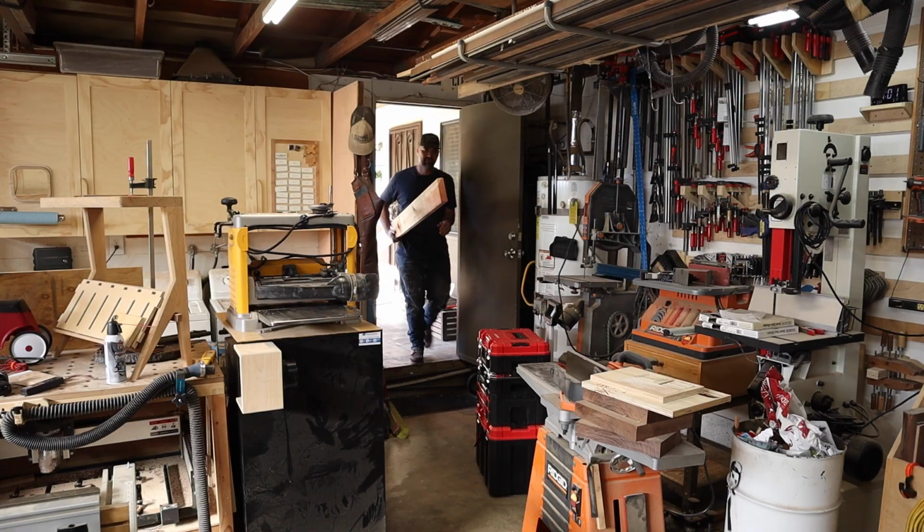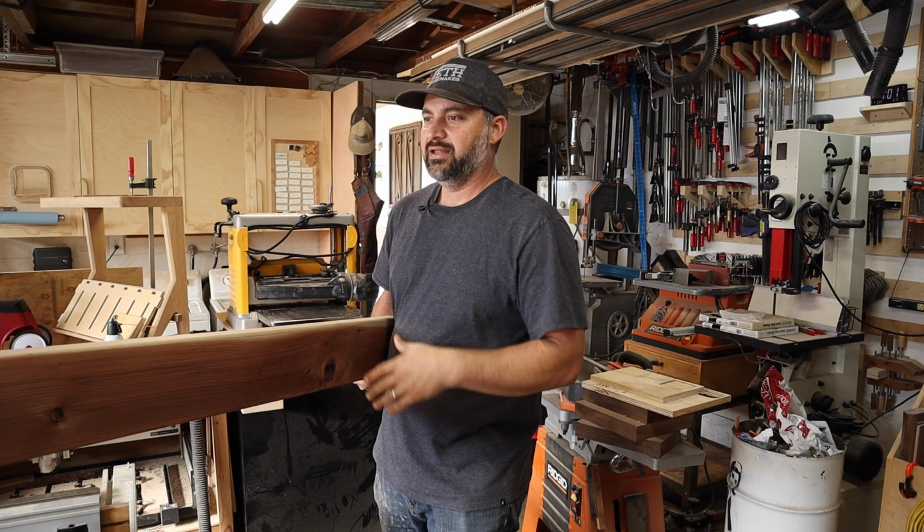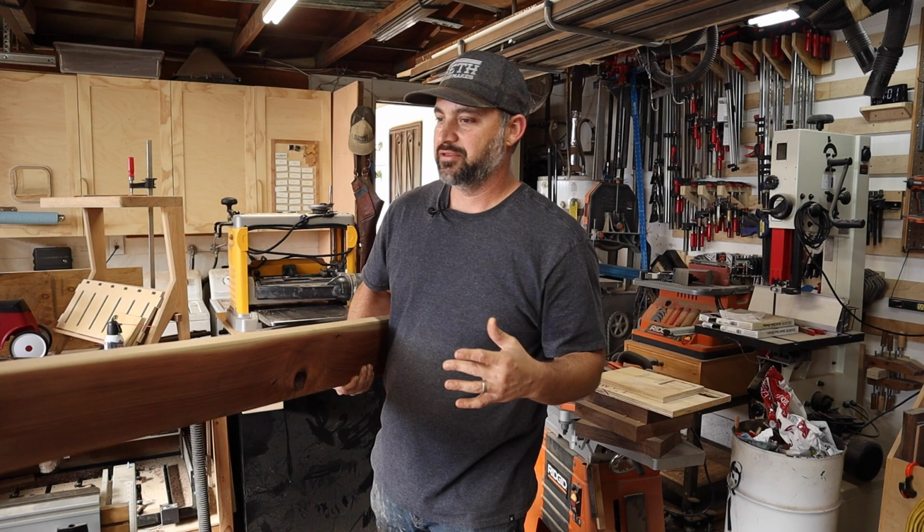So now that the outer frames are built, I'm gonna focus on working on the inside frame, and I'm just gonna use 2x6 redwood again, then I'm gonna rip it down to 1¼ inches, and I'm gonna do the same thing where I ripped off that front edge first, and that way I can get rid of that factory rounded over thing. I want these edges sharp.